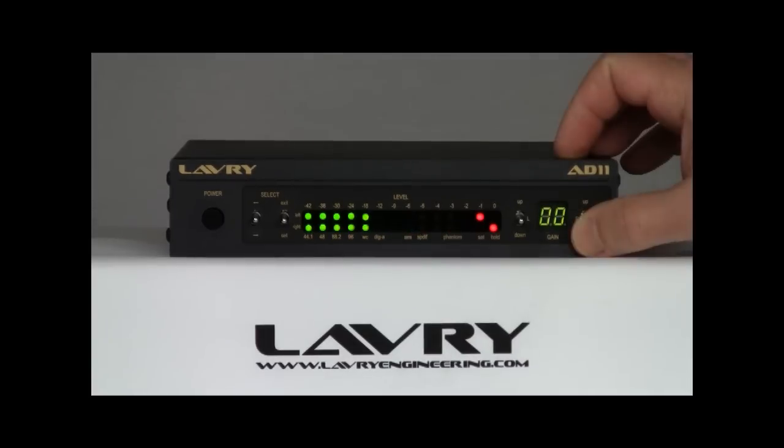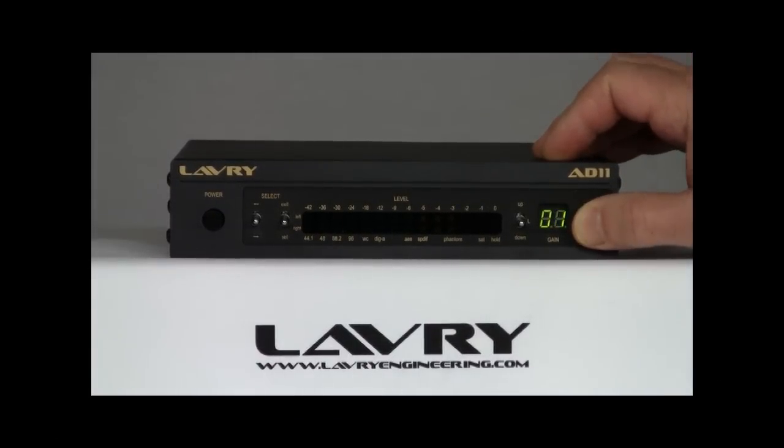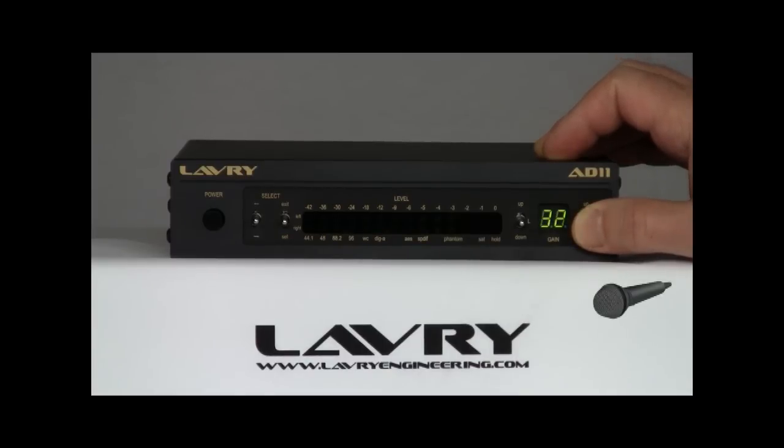For line inputs with either -10 consumer or +4 pro level, there are 12 dB of gain available in 1 dB steps. To change to microphone mode, you simply adjust the gain beyond 12 dB. As a safety feature, the gain display stops incrementing and starts flashing when you try to go past 12 dB. The switch must be released, and once the display stops flashing, the gain can be increased to the mic range of 20 to 65 dB.